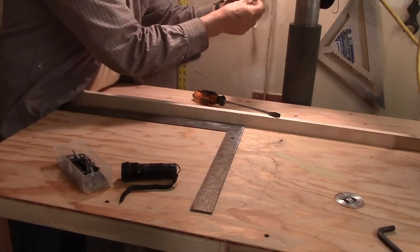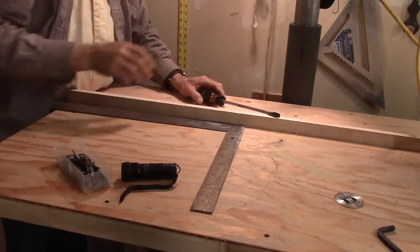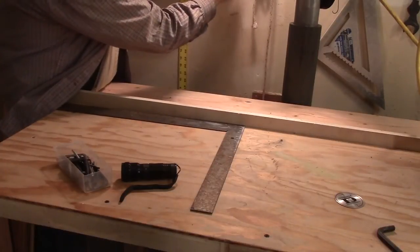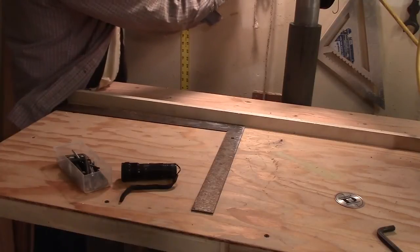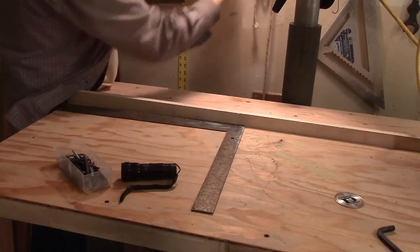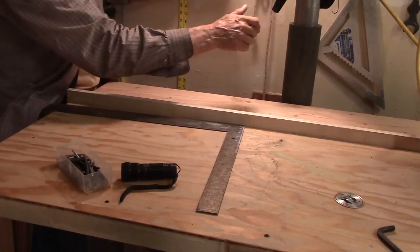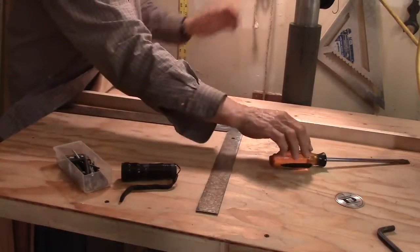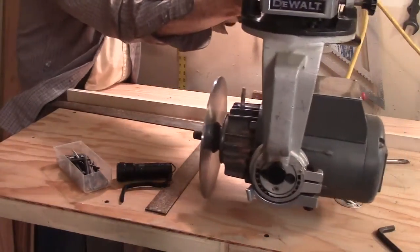The first Allen wrench I picked up was the right one. Those Allen bolts are steel bolts with brass tips, and those brass tips dig into the threads and hold these things in position. Now that should turn a little bit to the left. You saw the handle fall when I loosened that up because I removed the tension. I'm going to draw that away about a sixteenth of a turn and tighten this one. Now put this handle back under tension, swing it back around where it lines up with the cog down here, shove it in good and tight, lock this.